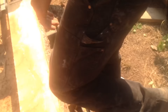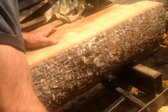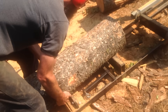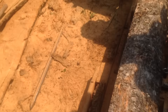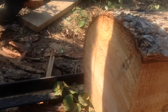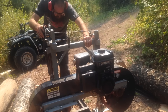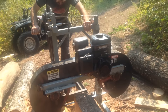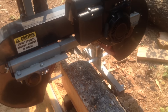I raise up the blade so I don't make contact on the way back, then release the clamp. Now that's the last time I have to use that clamp, because once it has those flat sides it's able to sit on the saw bed, and the saw bed has these little dogs that it slides up against so that it won't move. The saw bed really just holds it right where it needs to be. Here I'm making my actual size mark rather than trusting my rough mark — I make a pretty little tick mark and then try and go right to it. It takes a little bit of adjustment to find exactly the right spot, and once I have it, I'm into it.